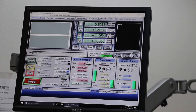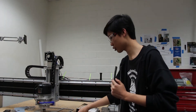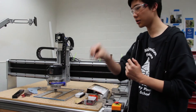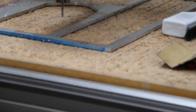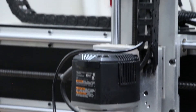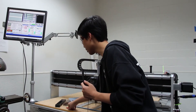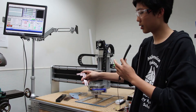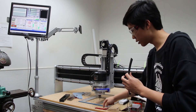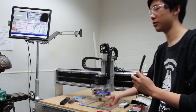Then you just hit Cycle Start and it will run the program. That's essentially how you run sheet metal. To mount sheet metal, we use screws — since we use an MDF sacrifice board, we can screw directly into it. The stock will have holes pre-drilled on a drill press or hand drill to screw it down. For parts, since almost all of our parts are cut from sheet metal, you'll usually drill first using a 3/16 drill bit through the part's holes, then use screws in some of those holes to hold the part down so that when you cut the outline, the part remains fixed to the table and won't fly out.